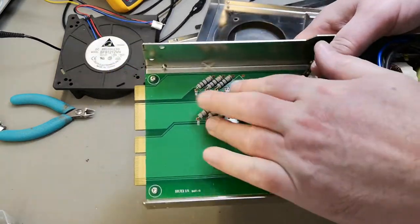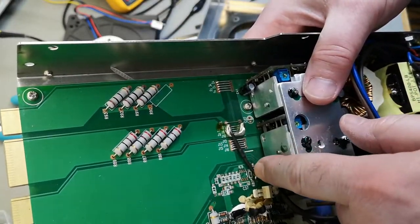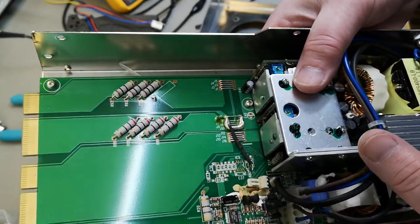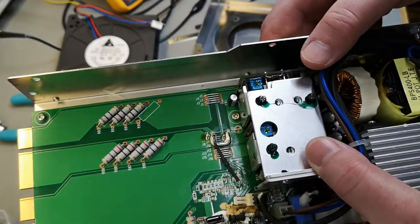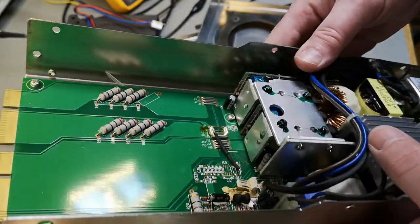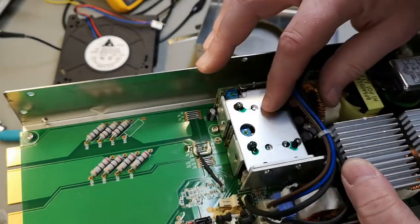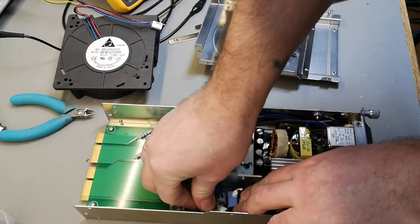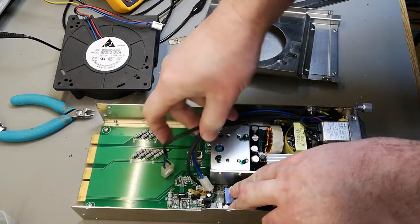Those are the minimum load resistors, and they're bridging a little sense signal. Why would you bridge the power stuff with your little sense signals instead of doing it the opposite way? That is just stupid — you need to sort out your priorities.